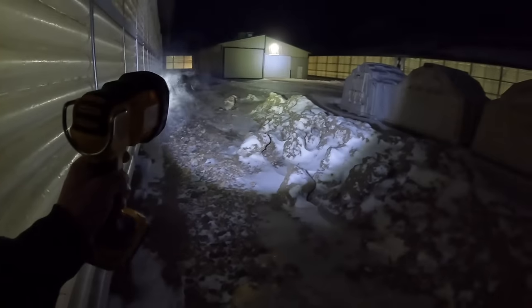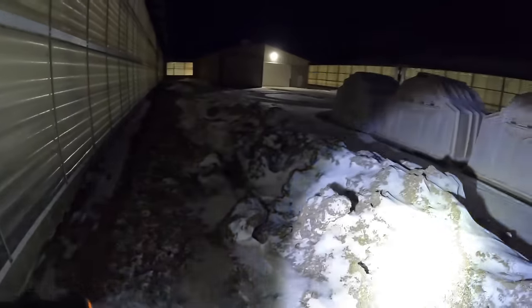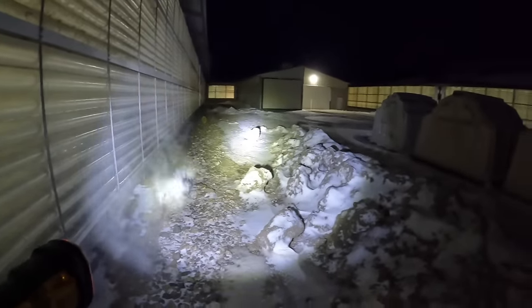So this is our manure separation building. That barn over there is the one directly behind the parlor, the one where I'm standing. This is the south freestall barn. There's a hydrant down there, and there are two-inch lines coming this way. One of them comes to about where we are here, to the last water troughs in this barn. The lines run outside the barn, and then they go straight in to both water troughs that are on the end here of pen 3 and 4.